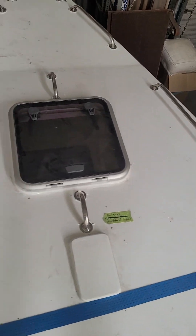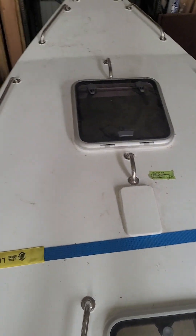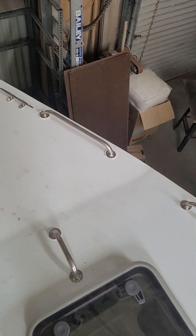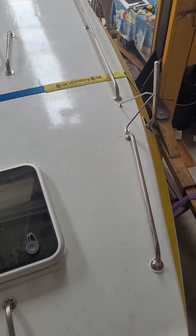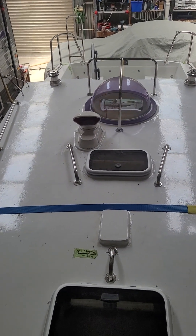Those two stanchions are required next to that hatch. The stanchions were a bit of a pain to get on — had to keep an eye out for the beams on the inside, but did get there eventually. And then obviously the toe rails all the way up to the front, plus another couple of 200mm cleats right up at the bow. So that's it — stainless work predominantly done, on to the next stage. Cheers!